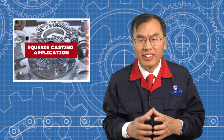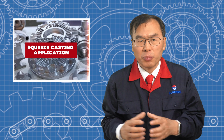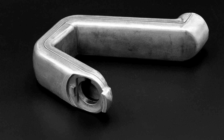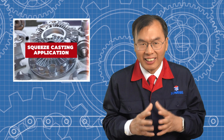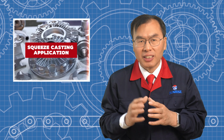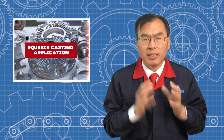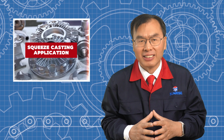Squeeze casting is widely used for parts that need to be strong, precise, and consistent, especially when safety or performance matters. Common applications include brackets, housings, arms, knuckles, and pump components. Parts that often require tight tolerance and clean, machinable surfaces. You will find squeeze casting used in industries like automotive, robotics, and even medical equipment, where reliability and weight reduction are both important. It's a great fit for structured parts that need performance without compromise.